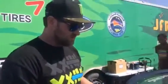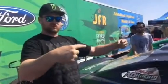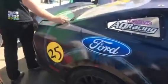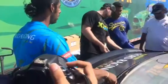Under the car, we have adjustable sway bars. You can't see it from the front, but they're different than the factory sway bars. The factory sway bars are molded and they bolt to factory locations. We have these single spline bars, and they're very easy to change. So we're constantly tuning the car. You're separating the forward bite and the side bite, and that's how we do that with sway bars and shock adjustment. Everything in this car is adjustable. If you go to a track and you need to be faster or slower or make it turn left better than right, this car has all that adjustment that you need.